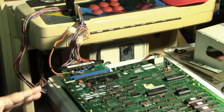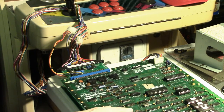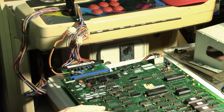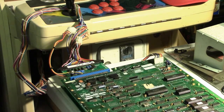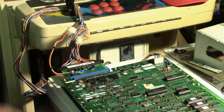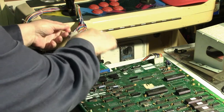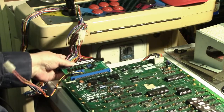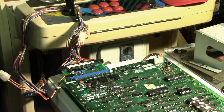So that's how I'm going to find out what's going on, because I still don't know whether this board is putting out the standard Nintendo monitor signal, or if somebody had burnt the proms to put out the standard signal so that you could run the board directly to a standard monitor, or if, you know, the inverter on the card is bad. So first, let me go ahead and hook this up, and we'll turn the board on, and we'll run it through the inverter direct to the monitor, and I'll let you see what it looks like.